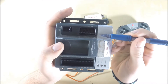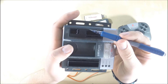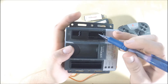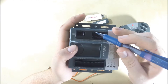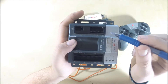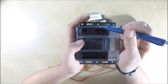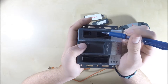This is exactly how you'll see it in the program as well. If you tell motor 2 to turn, that will tell port 2 here to turn that motor. So remember when you do your programming and wiring, you want to make sure you know which motor is in which port — whether that's the left front wheel, the lift motor, or whatever — and tell your programmer what motor is in what port.